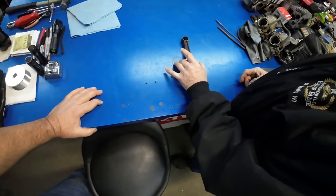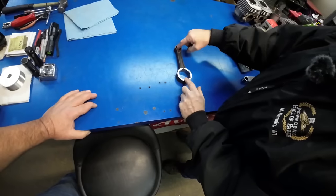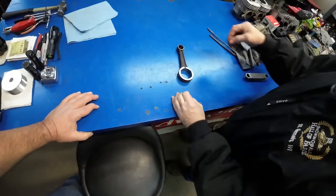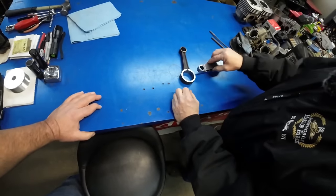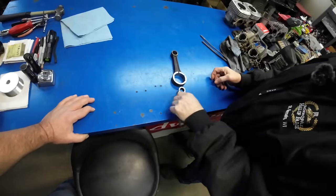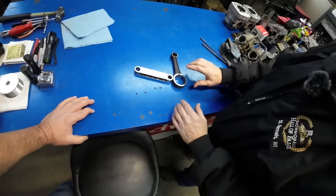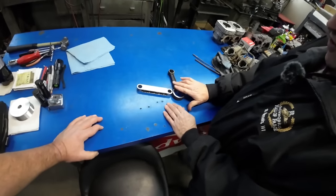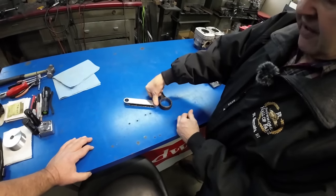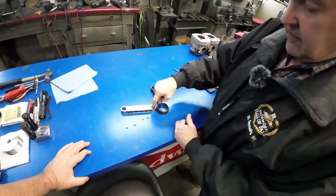So this would be the master rod, and you'd have needle bearings here and up here, just like you would on a regular snowmobile crankshaft. Now, you fasten five of these link rods on there, or four. You have one here, one there, one there. That makes a five-cylinder. I machined the bottom end so that it would overlap all these top and bottom, with a pin and a needle bearing. So the needle bearing that goes in here fits in here.